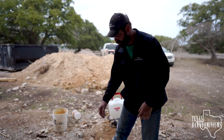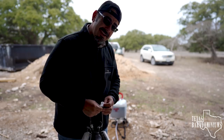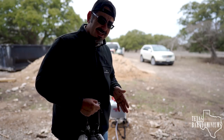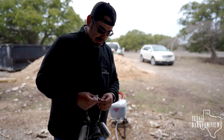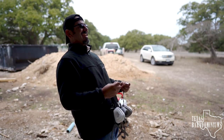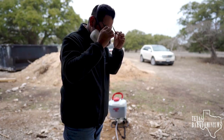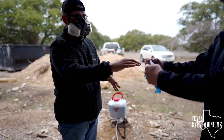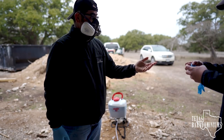All right Darren, ready? We're pretty much going to do the same thing all over again. I'm going to go in there, spray everything down with the new color, and we're going to let it dry and check it again tomorrow. We'll get here tomorrow and mop it — once you mop it, you'll get a pretty close idea of what it's going to look like once it's sealed. If the color is good, neutralize it and clean it up. If it's too light, you can apply another coat. I have a feeling this is going to be good enough, but we'll see.